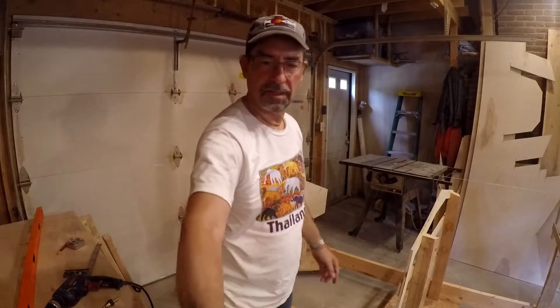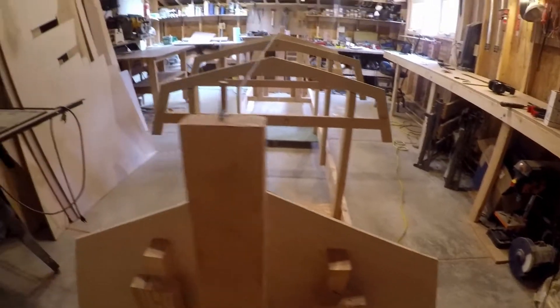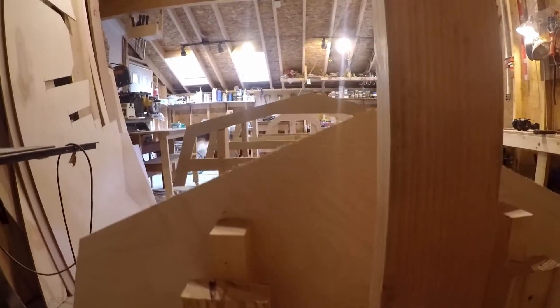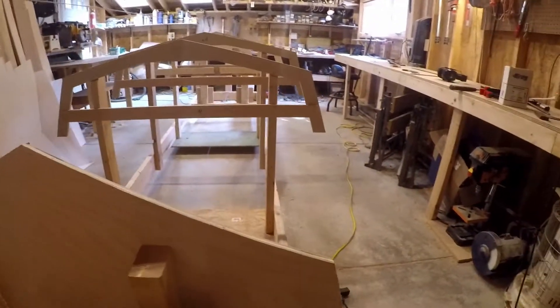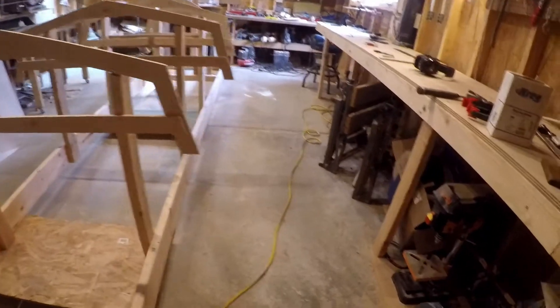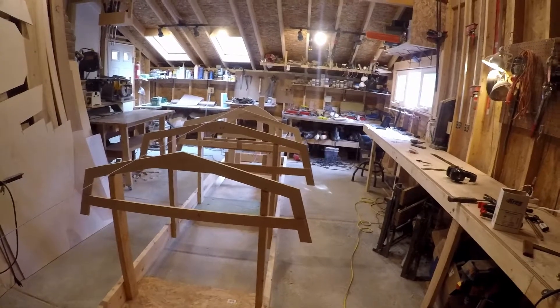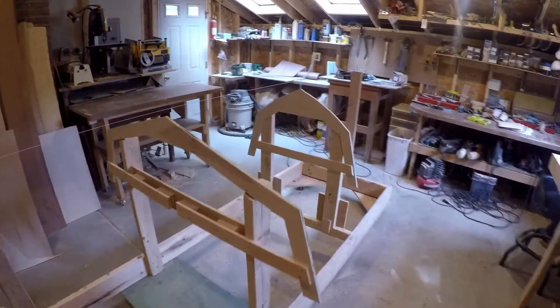Here's a potential outline of the boat. Let's take a look from the transom on out — it's sort of a steep curve. My eyeball tells me that transom may need to come up a little bit. But we'll start stretching some battens and testing these lines and seeing what they look like. That starts the next phase: trying to double check and imagine how these shapes will actually look in 3D.